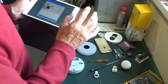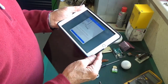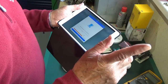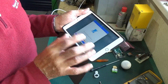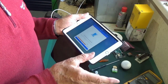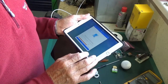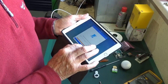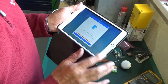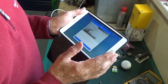I'm going to do all that when we've got this thing hooked up into the boiler. It's asking for an eco efficient temperature - 19 degrees or less. Choose a temperature for the hot water tap: it's a 20 kilowatt boiler on heat but 30 kilowatts on hot water. I want mine at 65 degrees because we've got a really nice big shower and we like it blasting out - my mixer tap will sort that out. Hot water next.